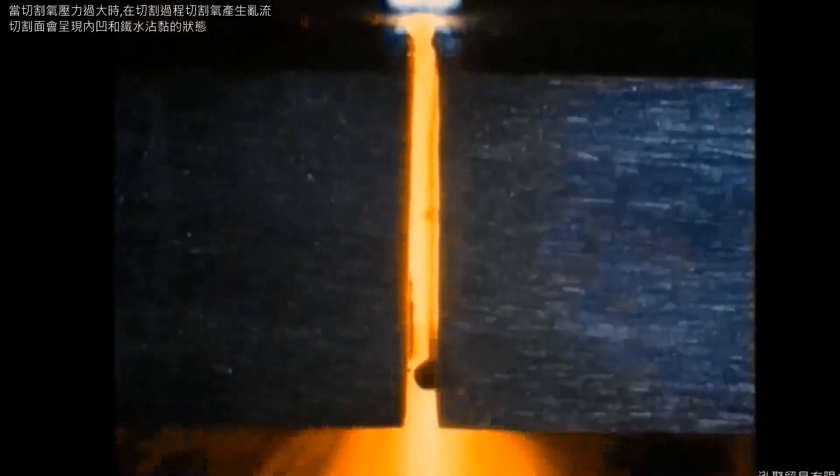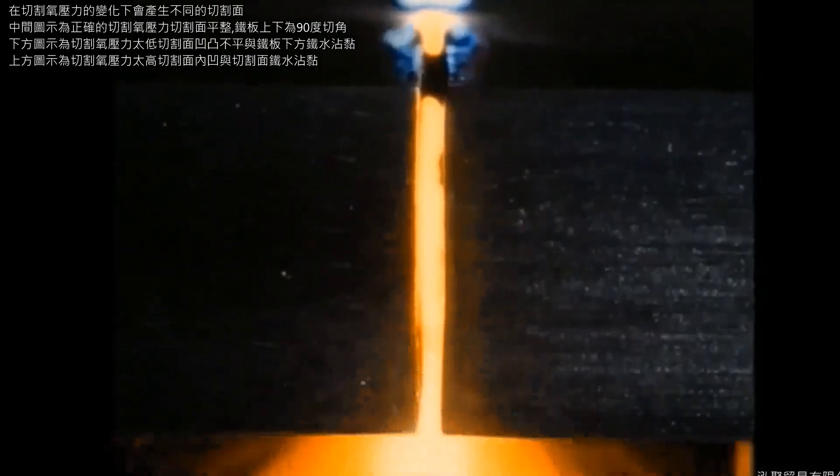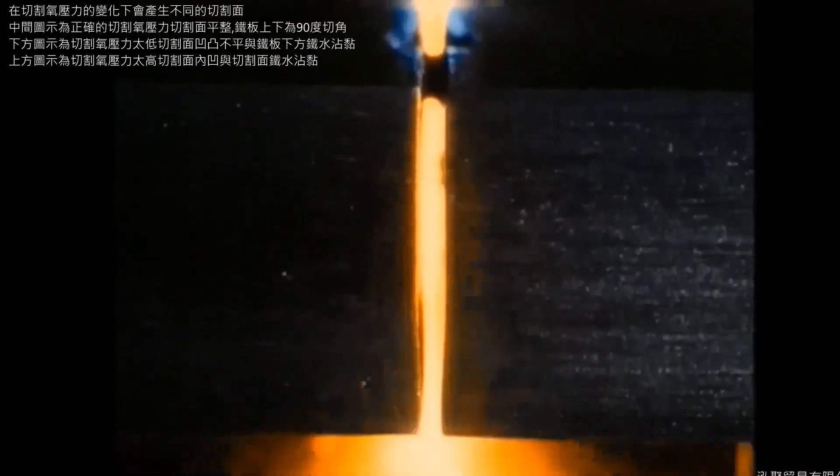To sum up, investigation of cutting oxygen pressure as one of the influencing factors shows clearly that only maintenance of all cutting parameters can give optimal quality of the cut — low drag as seen in the picture of the cut at the right, minimal unevenness and clean cut edges as shown by the kerf profile at the left. Too low cutting oxygen pressure causes narrowing of the kerf towards the bottom, that is, angular deviations and more drag. Too high cutting oxygen pressure similarly causes angular deviations because the kerf widens towards the bottom, and under certain circumstances also rounded lower edges.